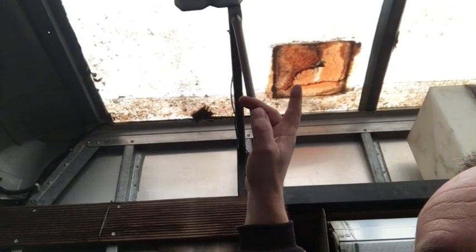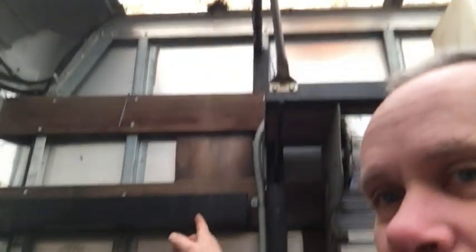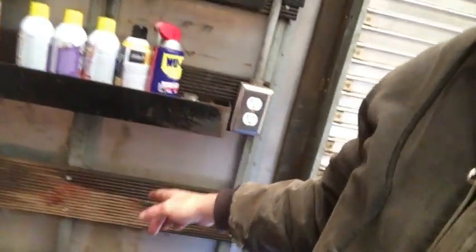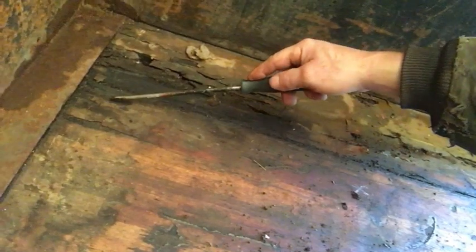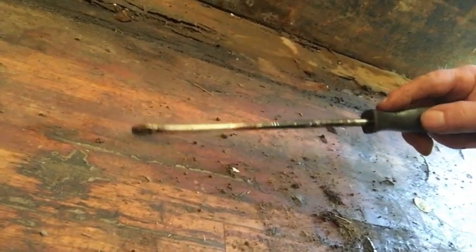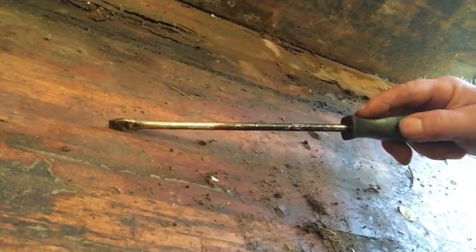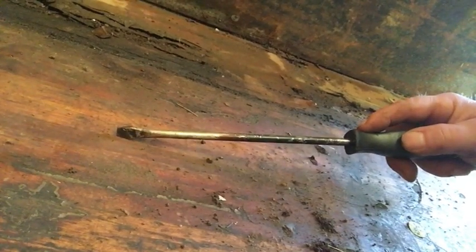That patch, as ugly as it looks, is not a hole, but right over here there's a hole, and it's been leaking down the wall and down to the floor. This piece right here is laminated oak — pretty tough panels — but after a while, like any wood, it'll rot out, so that has to be replaced. This one's still solid so I'm going to leave it, but from here back to the wall and all along this whole piece here I'm going to replace. I built another panel with one-inch wide boards that I milled yesterday.